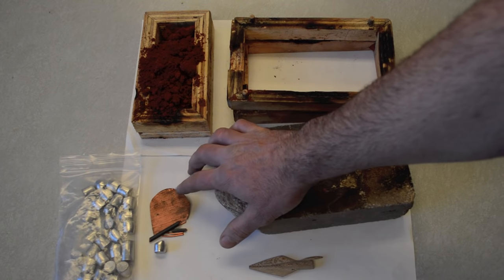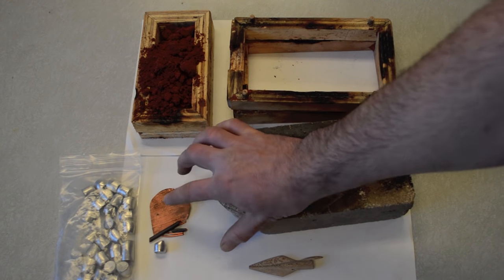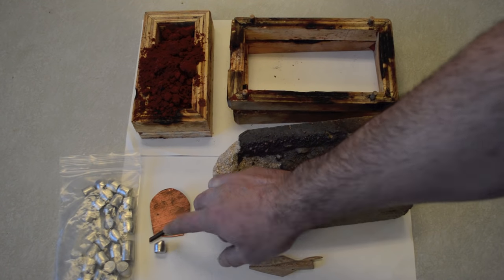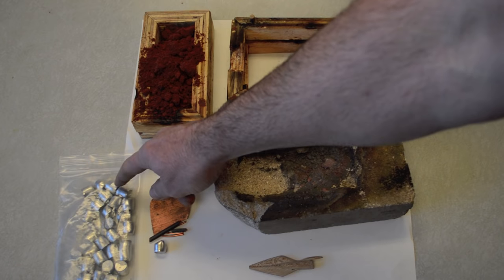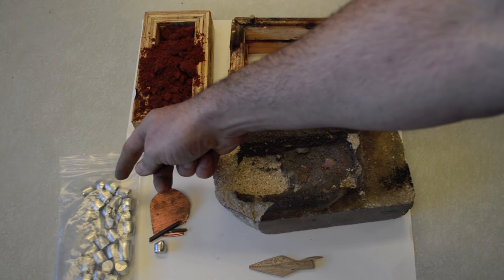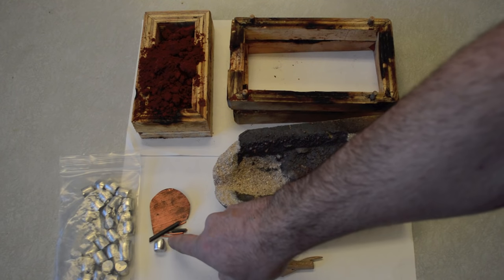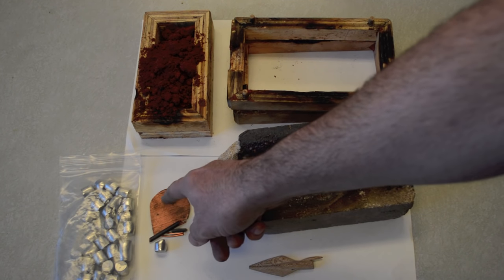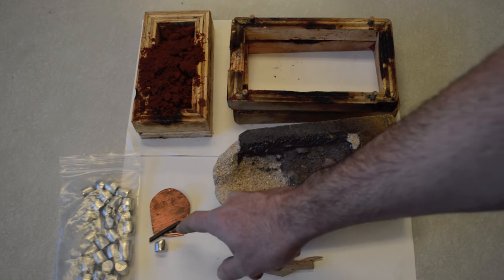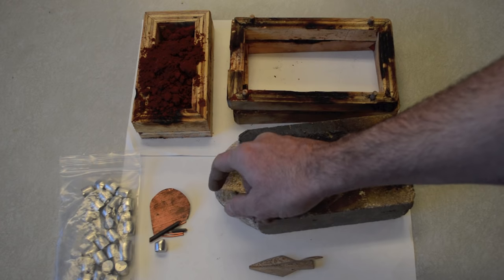You'll need some of the metal. Bronze is 88% copper and 12% tin. I got the tin on Amazon and it comes in cut wire lengths — it's pretty much pure tin. You just weigh out the measurements to get the ratio. I have four ounces here, and when we melt it the tin and copper will mix together to make the bronze.